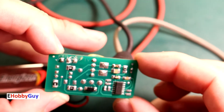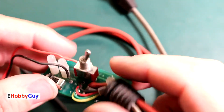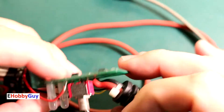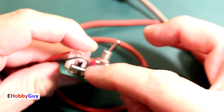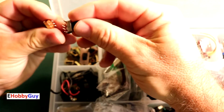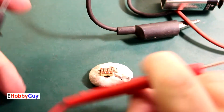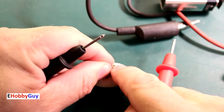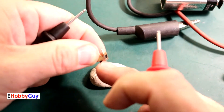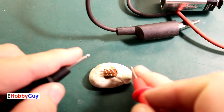We definitely have a problem with the switch and also these power wires. These look like SMT push-on connectors — not the greatest, these can corrode over time. I am going to take a quick break and look for a replacement switch in my box. Much to my amazement, I do have a very similar switch. These are both two-position, three-pin switches. Testing my spare switch: with the switch to one side, center and the right pin are shorted — definitely not across all three. Switching to the other side: center and the left pin are shorted, definitely not the outer two pins.